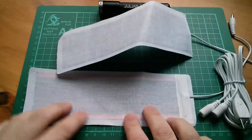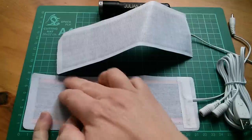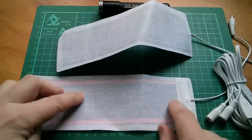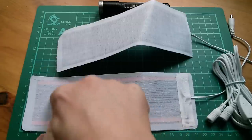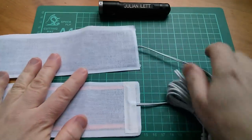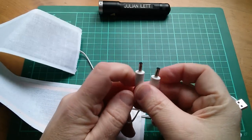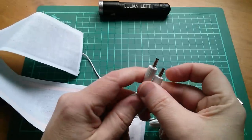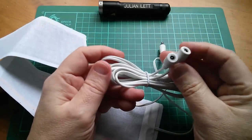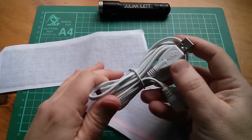There are two heating elements here. From my mat you can see they're 210mm long and about 75mm wide. You can see the copper strips running down there, and then there are bridges across which are the heating elements. These terminate in little connectors — about 4-point-something millimetres, I think these are mini DC power connectors. You get a USB cable with two of these little power adapters, so we can run both from one USB port.